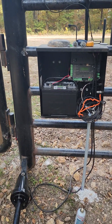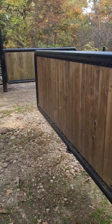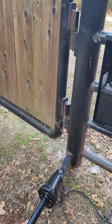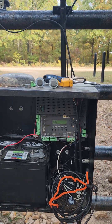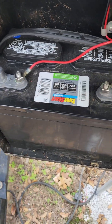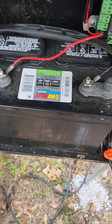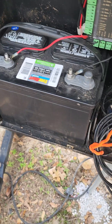Hello everybody. Today the purpose of this video is a discussion on my Apollo gate, my heavy duty gate and these actuators. These actuators are Apollo 816s and their boards are an Apollo 1050. I'm running an Everstart deep cycle battery — not the Apollo expensive battery. If you look up the specifications, the 24DC will work just fine.